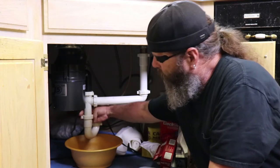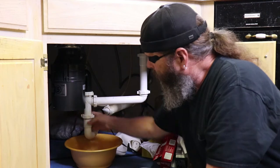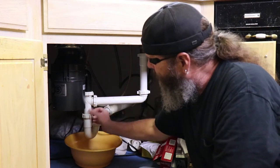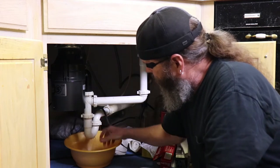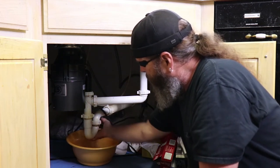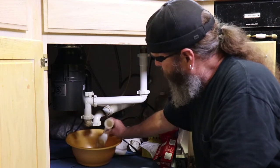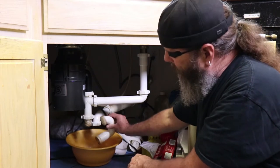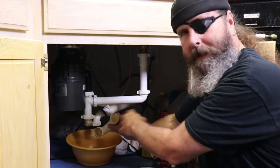With PVC, it just comes off — it's only finger tight — so we'll take this one loose first. You want to put a bucket or something underneath here to catch the water, because it's going to get messy. Then we'll take it loose from back here, and here comes our water. This just comes off like this. Then you want to look into here, and if you see some types of sediment that's blocking it, you can just knock it out. Maybe you want to take it outside and knock it against the side of the house. You can take a screwdriver, pliers, whatever, and make sure you get that all cleaned out.